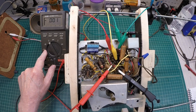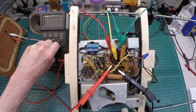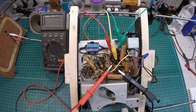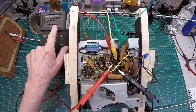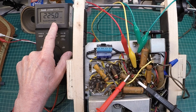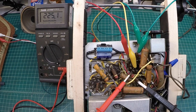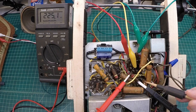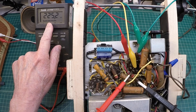The voltage drop across R7 is just a little north of 29 volts DC. After discharging the electrolytic capacitors, our voltage has settled down. Flipping over to DC resistance, across R7 we're looking for 220,000 ohms, and you can see we're almost spot-on in circuit at 225k. So that resistor is good. Let's plug the numbers into the calculator and see what the plate current comes back to be.